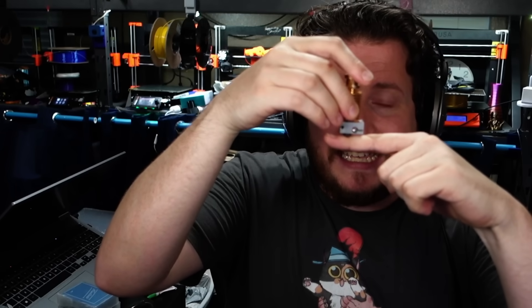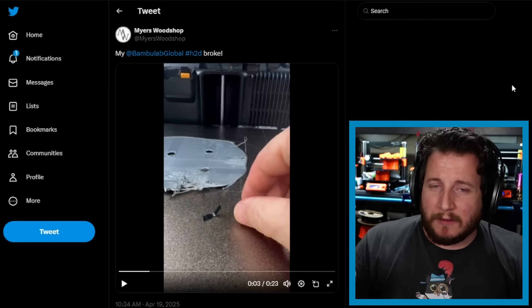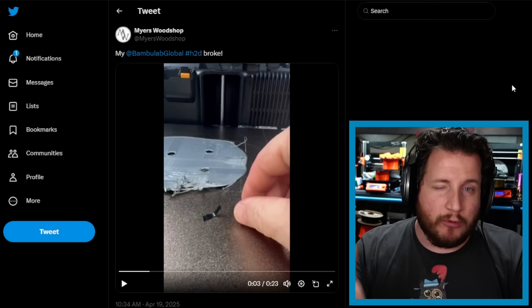However, there may be small weaknesses: the wiper itself is a thin piece of metal designed to press against the nozzle. The Prusa XL does something similar with a rubber wiper it docks on. The adhesion issue here is most likely from a dirty bed — especially with textured PEI where adhesion fails in one spot but is fine everywhere else. I would have liked to see the machine catch this, given the H2D has so many cameras in it.